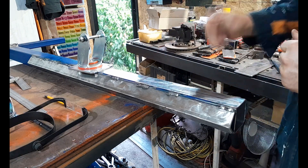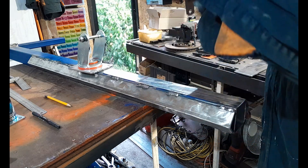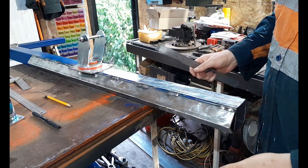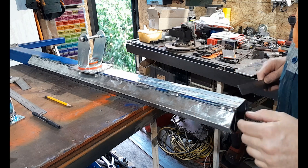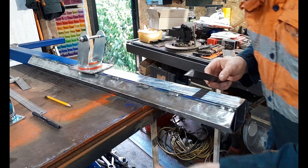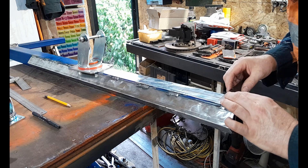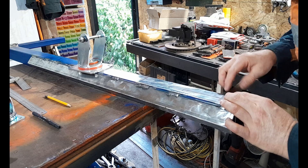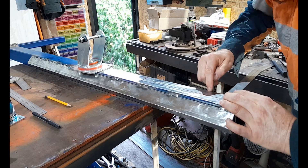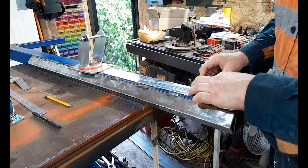I used my magnifying glasses here, as recommended for old people. It can be hard to measure once we've got our trolley roll on. The roll box can be quite hard to measure on the rolled edge — it's easy to measure on the side but hard to know where the edge is. Work off your 65 millimeter mark, look straight down where you're measuring, and get your 65 mil mark right on the edge where the rolled becomes straight. Then mark in your 32.5 millimeter at a couple of locations along.